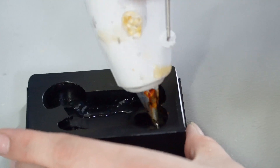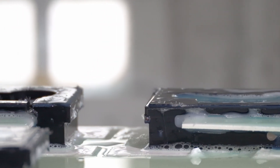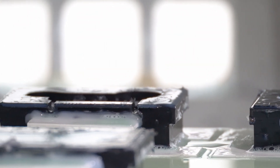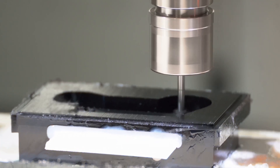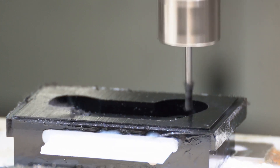Before putting this part on the 3-axis CNC machine for final machining, it is extremely important to fill and tighten the slot with some small boards. These boards will provide support against the pressure of the machine tool as it cuts from side B. While cutting side B, as the material is cut away, the strength from the surrounding material which helps hold side A and side B together gets weaker and weaker.